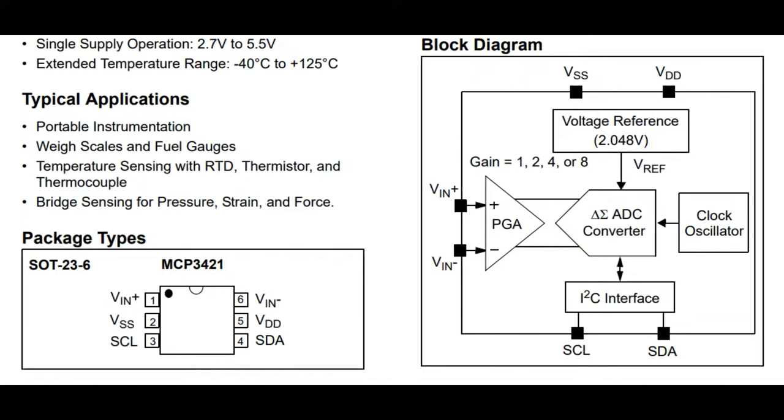So you see at the bottom left, this chip, by the way, is I2C and it has a fixed address. You can see there's no address pin. But there are variants, different variant ordering codes, that come with different addresses, and I think I have a diagram later of that. Differential input, powered from 2.7 to 5.5 volts. The internal reference is 2.048 volts. So your signal has to be within that range and it's differential. As long as both positive and negative are between ground and 2 volts, you'll be able to read the differential signal in. And then just I2C for configuring and reading back.